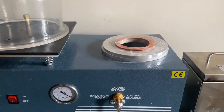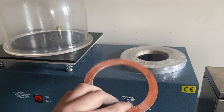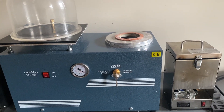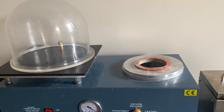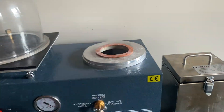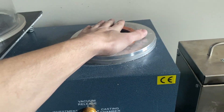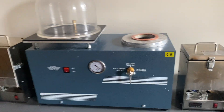On the other side we have the casting chamber, which also works extremely well. This is a third-party gasket I bought because over time I deteriorated the quality of the first gasket this machine came with. In general this part works really well. If there's going to be an issue with this machine, it's going to be over here, and it's not going to be because of the machine — it's going to be because of you not ensuring there's a good seal. Personally I've had one or two experiences where there was not a good seal. One time I didn't catch it and my part completely failed. The other time I did catch it using the gauge — I saw the vacuum didn't pull fully, took a moment to ensure the seal was good, pulled the vacuum again, and it worked. It's great that we have this gauge so we can confirm a good seal. The third-party seals I bought are a little tight, but in general this is really well built and I've had no issues with it.